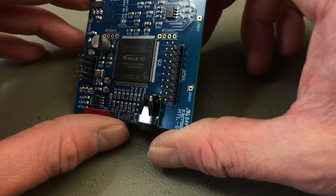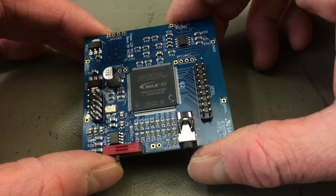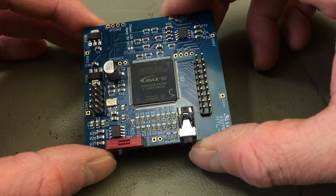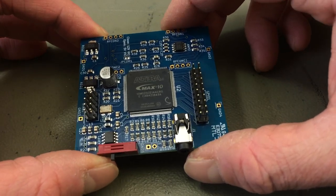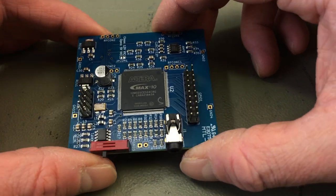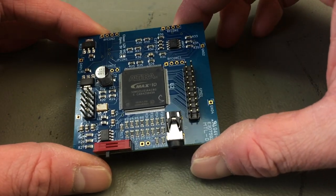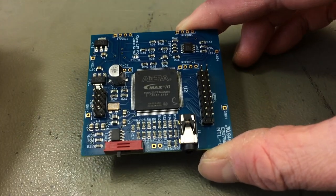And according to the GitHub from Copper Dragon, it is also keeping the video signal that comes from the regular AV from the C64. It keeps that signal intact, so you can also use the composite signal as you would with the normal C64 cable. And you can also use the S-video or pre-S-video signal that you get there, Luma and Chroma. So this is one part of the whole business.